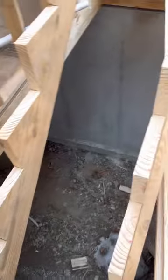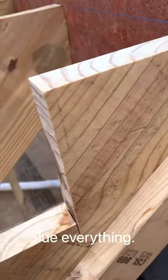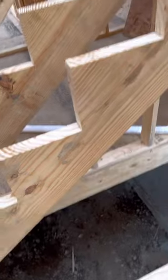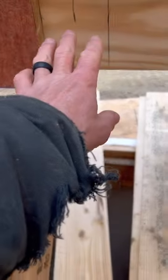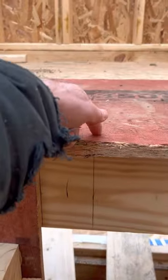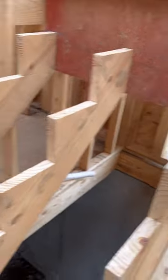So, yeah, that's it. I'll put hangers on here, angle bracket, hanger, hanger. I like that the riser sits on there. I feel like this is the way to go. And so I'm gonna cover these up with risers, put my treads on. If these were temporary treads, I would just screw them down. Since I'm gonna be keeping them here, I will glue them. And we've got 3 inches in between the set of stairs here because there's a wall that comes up between the stairs, so this will all get notched out as needed. More or less, the hangers are going to sit on here and go up to the next level. Identical set of stairs mostly. That's how you do it.